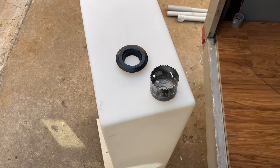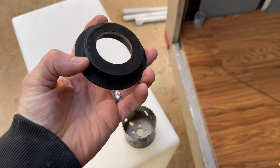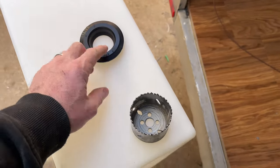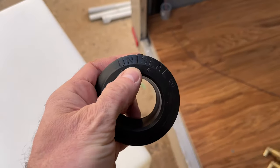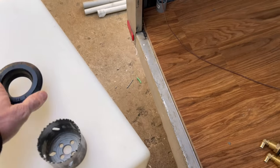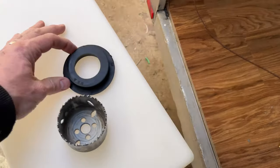So the first step for the tank is I'm going to install the fill. You're just going to use this Uniseal here. To put that in, they say there's a chart, and it's a 2.5 inch hole saw for a 1.5 inch Uniseal. So it's got to be this brand, I would think. There's probably all sorts of different ones, but anyways, for this brand, 2.5 inch hole saw. And you can tell on the back there,